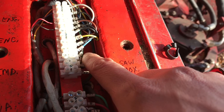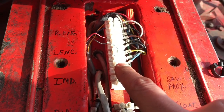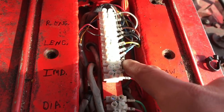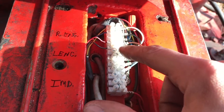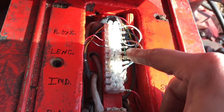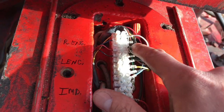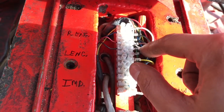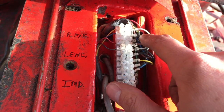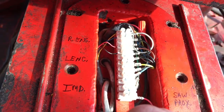The rest of these wires we don't even use. This thing was set up wired as if it has a diameter reader, but it doesn't — I'm not sure if it was an add-on option or just never got used because it's not accurate with these machines. This is not the most high-tech technology, so I don't know why they wire it up for all this stuff if nobody uses it. Why not just leave the four wires? Anyways, another rant. I'm just making sure because the new harness will have different colors, so I want to get it right from the junction box on the boom to here.